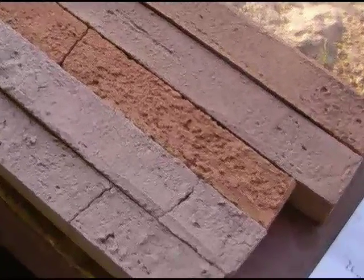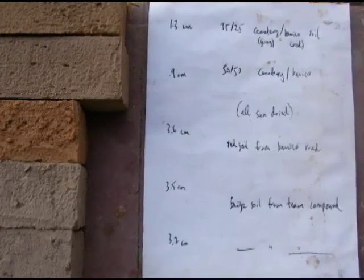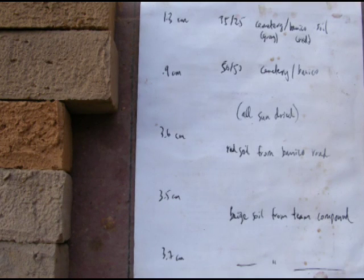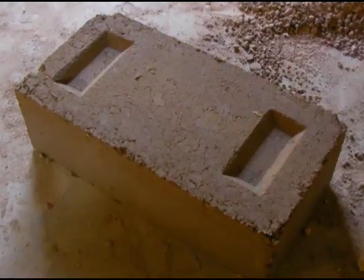I've mixed them up a little bit and shrunk these in the sun. The top two are mixtures of the sandy and the red soil, and they've just barely shrunk. That means I'll be able to use those at about a 1-to-18 ratio of cement to soil. With the right soil and proper mixing and pressing, you should get a nice block.